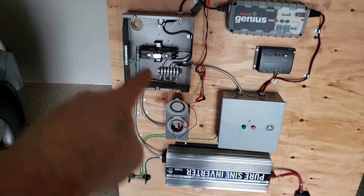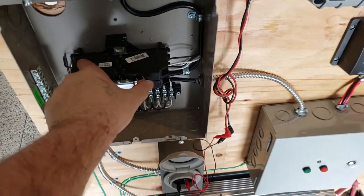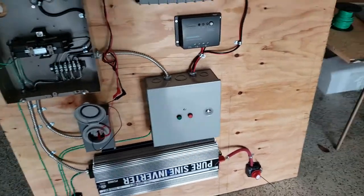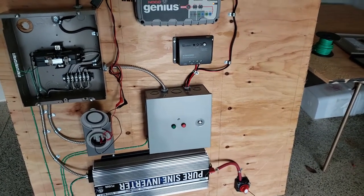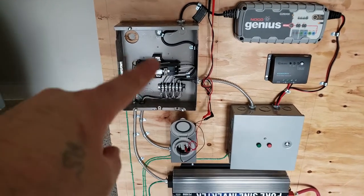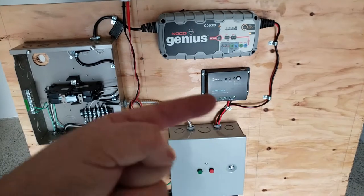It's really simple — the inverter feeds the panel out to the house, or the generator feeds the panel out to the house. Depending on which service you want, you just flip the switch and it disconnects one and connects the other. This other box controls what's charging the batteries. If the solar system isn't keeping up and she needs to plug in the generator, she can leave the panel alone and run off the batteries and inverter, or flip it over and run off the generator. This device lets her choose whether it's the generator's charger charging the batteries or the solar system.